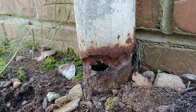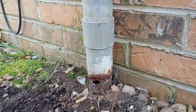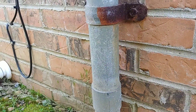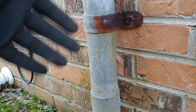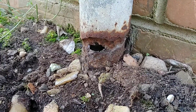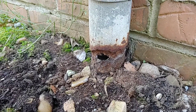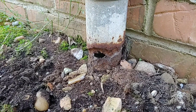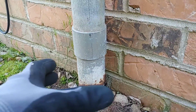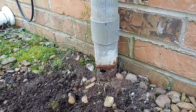Most of the time nowadays you use PVC coming up, but this is an older home done in the 60s. We're going to show you a repair on how to fix this without replacing this conduit right here, because you would have to take the panel off the wall and try to slide that out. But chances are you're not going to get that wire out anyway because it is direct burial — it goes down about 18 to 24 inches underground, depending on how deep they dug it. You'd have to dig all the way down to pull it out, and that's not going to be easy. So we're going to sleeve this right below this coupling right here and pour some concrete in here.